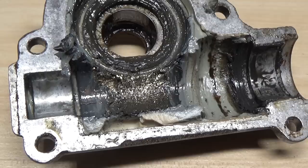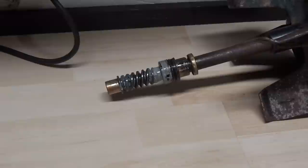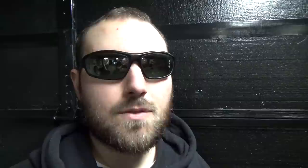Now I'm going to have to go in here and clean up all those little brass bits, because once I put a new gear in there, I don't want it to pick up a burr or have a chunk of metal in there and cause a problem down the road. So I have to order this gear, and then I'm just going to inspect the worm gear over here to make sure it's okay — it looks to be in good condition, no chunks missing, which is a good sign. That'll save the customer a little bit of money, so I'll get a part number off of that.